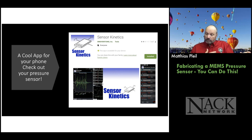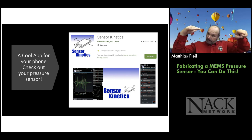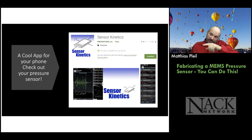If you look at the accelerometer, it's a three-axis accelerometer, at least on my phone, so I can look at X, Y, and Z motion and get the G-forces in all three directions. It's so much fun to play with. But with regard to the pressure sensor, I can tap into the pressure sensor part of the app, and it'll give me the pressure of where I'm at. If I take my phone and put it on a table and take the pressure reading, and then put it on the floor and take a pressure reading and zoom in on the graph, you can see where the pressure goes up when I put it on the floor. And you can get the millibar difference between tabletop and on the floor.